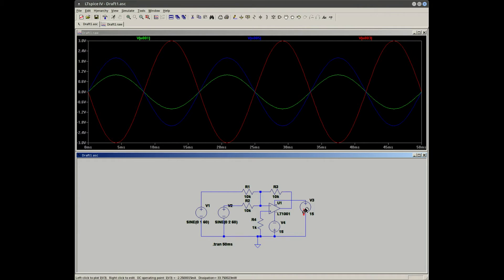It'll treat them individually where each has a gain of one, so it'll be one volt plus two volts summed together, three volts, giving negative three volts out. To see if this is true, I'm going to change R1 to 5k and run.